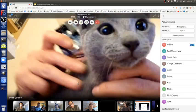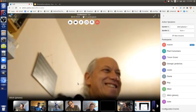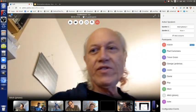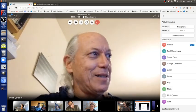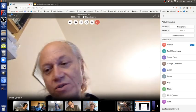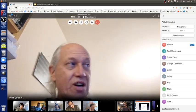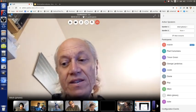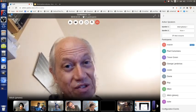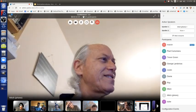Just like before, except now there's a different chip in there with either no program or an old program that needs to be overwritten. And you do that the same as before. You don't have to redo the tools menu with those two setup things, because it's the same board and the same driver, the same port and all that. You just click the upload button and it'll do its thing, normally in a quarter second instead of a minute, like it's doing on my computer,